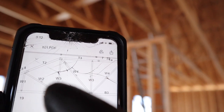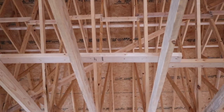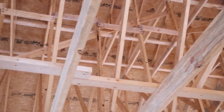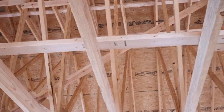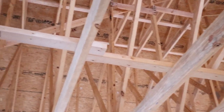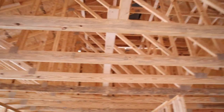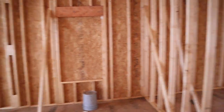And then I'll just take 16-footers and run the rest of these. Those two-foot blocks going across are what we put in as I set the trusses, and those are already on the details to be put in — that part's already done. So there's a couple more runs that go through on these trusses to complete them for the bracing. The first thing I'm going to do before I get started up here in these rafters and spacing these trusses out and bracing them — I'm going to cut out these windows.